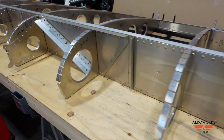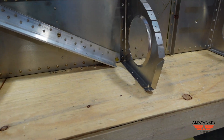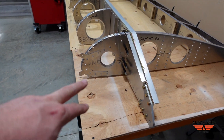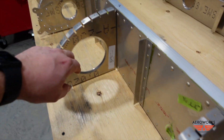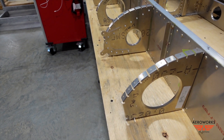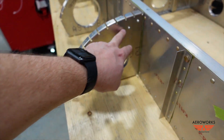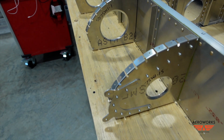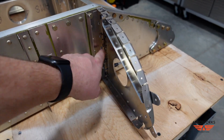You can see the fuel tank bay here — this is all riveted up. The nose ribs are coming on. There are some nose ribs that have both AN bolt hardware as well as rivets; some have bolts on top and bottom. This is one of those things you really have to follow the plans on, because while these ribs are all the same shape, they have various size holes depending on whether they have a slat bracket or not. So make sure you write all those down. When you take the labels off, it's always a good idea to write the part number on there. The only thing you have going for you if something gets miss-sorted is that the slat bracket ribs will have holes in the nose as well as angle holes for the support, whereas the others do not. You can also look at the size of the lightning holes. Rib one's nose rib does not have a flange — it's flat — and you actually have to put an angle in there for that nose rib.